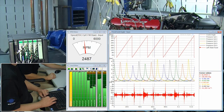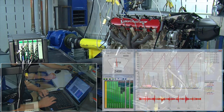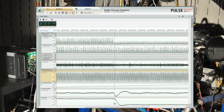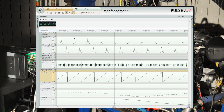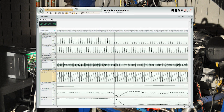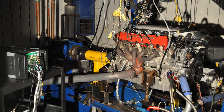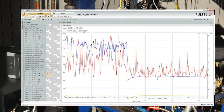From the cylinder pressure data, it is clear that one of the cylinders has a problem. The initial display during analysis confirms the monitoring data of the cylinder shown during the test. The lower part of the display shows a drop in RPM and torque as one of the cylinders misfires. This is further illustrated in the subsequent displays, where the drop in pressure of the faulty cylinder is shown in 2D and 3D as a function of cycle number. The cycle statistics graph shows maximum and mean curves of a vibration signal and cylinder pressure, illustrating the drop in pressure of the faulty cylinder.